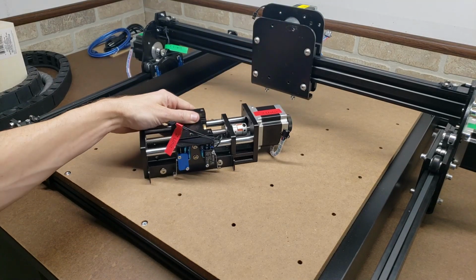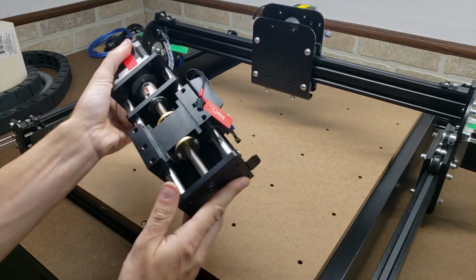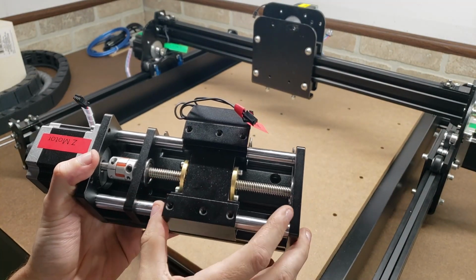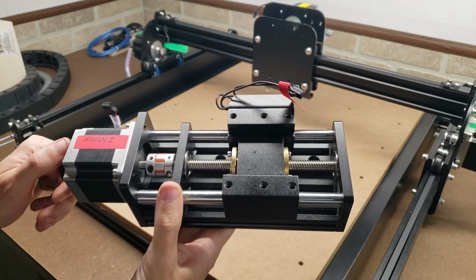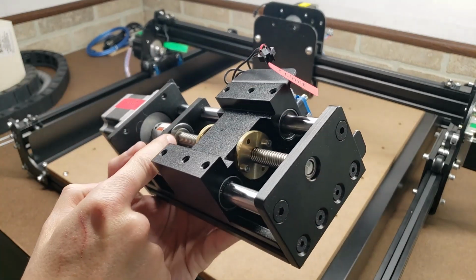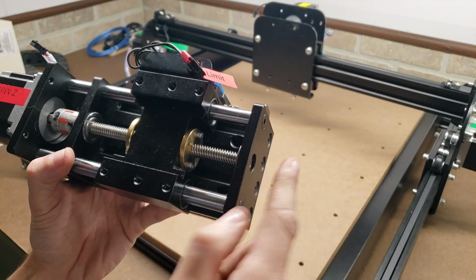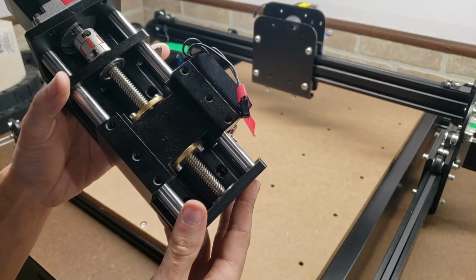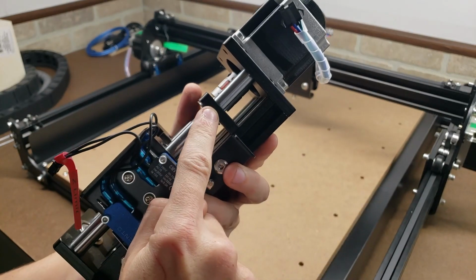And I always stress to look over every nut and bolt, and I'm glad I did. So one thing to keep in mind and to understand is that the lead screw here, as it's driving the carriage forward or back, that force has to be held back by these thrust bearings. And usually they'll face each other on one bracket, and there'll be a nut with a set screw to set the preload on the thrust bearings. But here there is no nut to do that, so I notice it's this plate here.